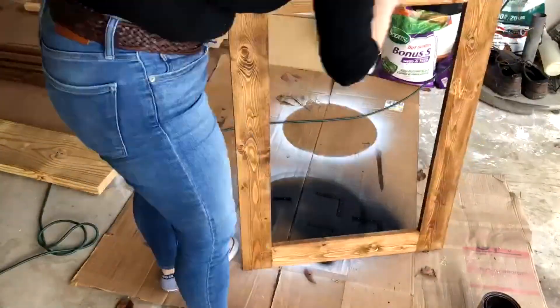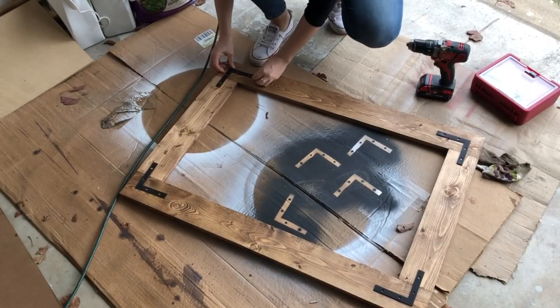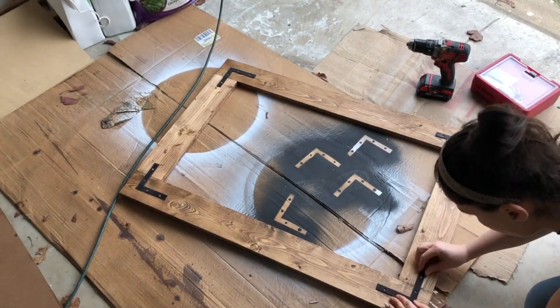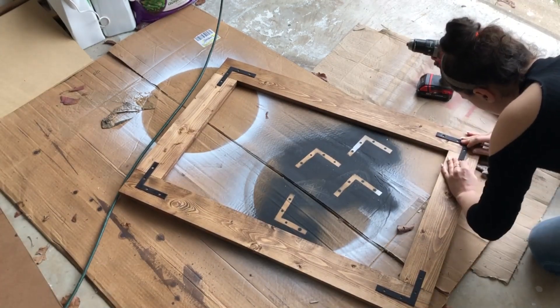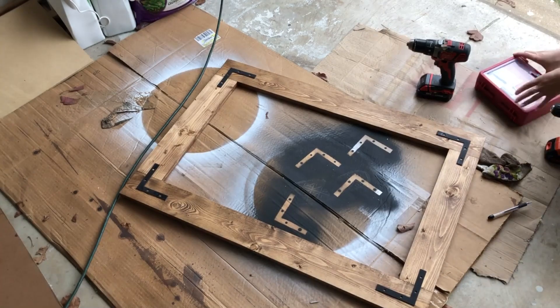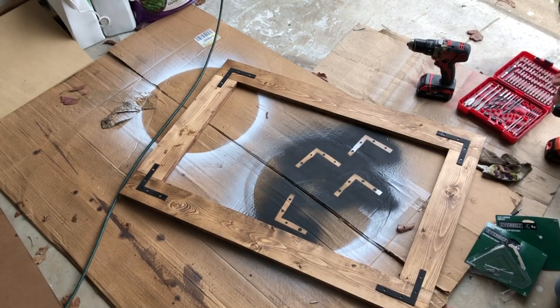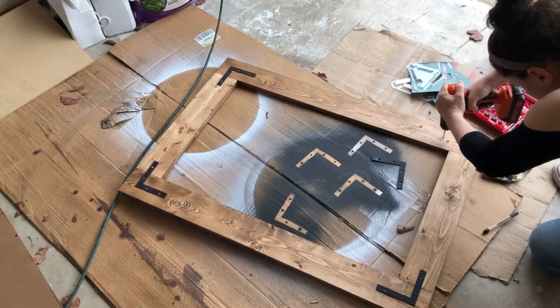In the third phase of this project, I tried to create a wooden frame using pocket holes. In a future video I'll completely show you how to use a pocket hole jig to create pocket holes and connect two pieces in a way that the connection and screws won't show on the surface — it's going to be a hidden connection. After creating the wooden frame, you can paint it or stain it depending on your design.